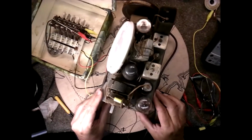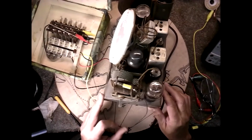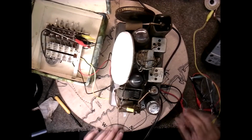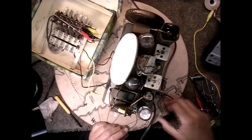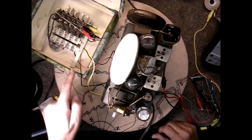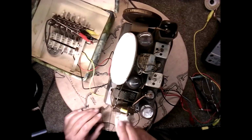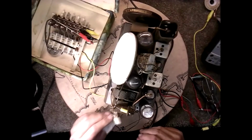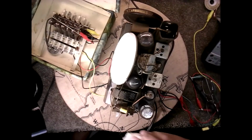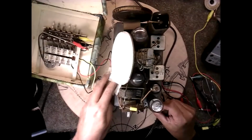I don't think that thing's isolated. No, it looks like it's sitting right on the chassis. A lot of them are isolated, but that one doesn't seem to be. You've got to be careful of those wires. Don't want anything messing up down under there. I've got 4 jumper cables going in where this goes, and they're right next to those 2 goofy capacitors that are sticking up, bouncing around. I've got to replace those electrolytics, but they can wait. They're fine, they're working.